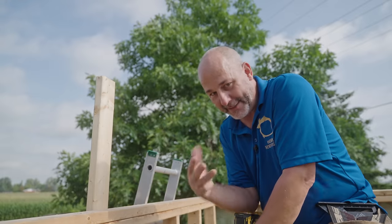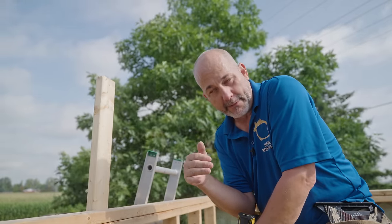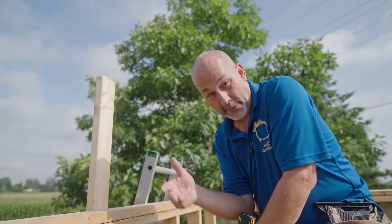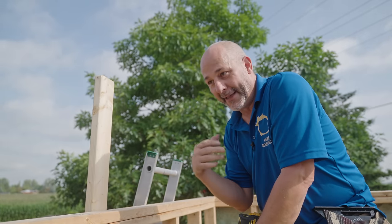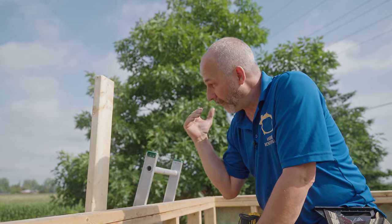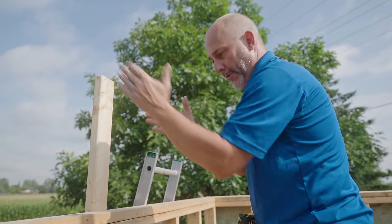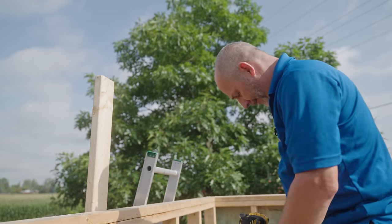All right guys, so there's basically three kinds of roofs out there. One is a single slope, and if you were following along, we did a couple of different sheds with different kinds of single slope. We did one that just had a waterproofing membrane on it, did another one with a metal roof. Today we're gonna do a ridge beam. The third kind is truss, and that is a prefabricated roofing system that you just set on top. Now, we're gonna do the ridge beam because it's really convenient and it gives you a lot of flexibility, right? Because you can change the position of the ridge, move it forward or backwards, and have two different sizes of slope if you want. Today we're gonna try to go right down the middle.